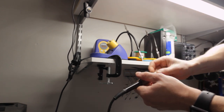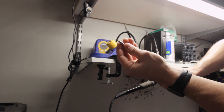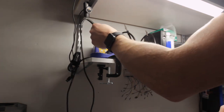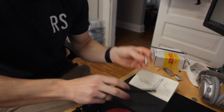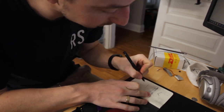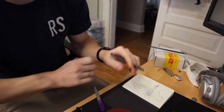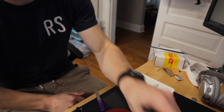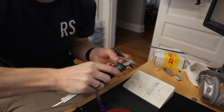What I'm going to do is take out my current soldering iron tip and use it as a reference on the lathe. I'm going to cut it to similar dimensions so that I can install threaded inserts with it. The good thing about this is that I can set it to different temperatures depending on what plastic I'm working with. It's going to be shaped similarly, with the end that will allow you to install the threaded insert, and I'll reference it to the actual insert when I'm on the lathe.